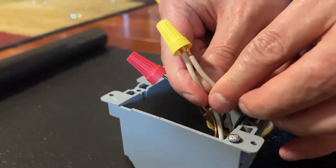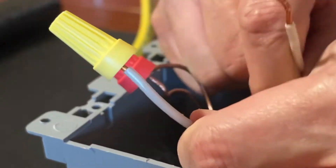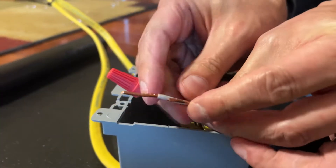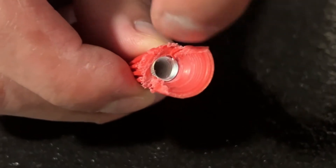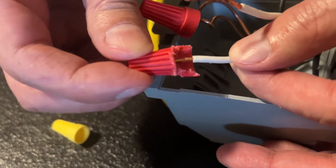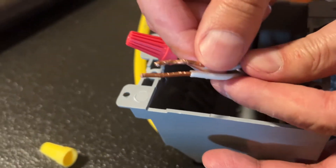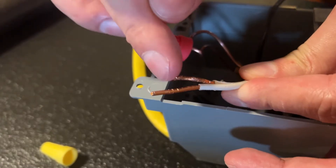Here's number one. If you look at your wires and you tug on one, it's loose and it actually comes right out — bad connection. So when you investigate what happened, one wire was way longer than the other wire. When I took the time to cut away one of these electrical caps, I see there's a thin cone of metal on the inside. That's the way these work. When the electrical cap and the wire meet deep inside, it will lock onto the wire by twisting it on. However, if one wire is dramatically longer than the other wire, it will be a poor connection and fail.